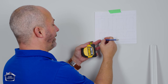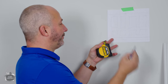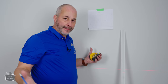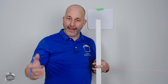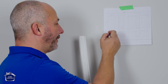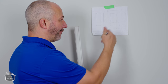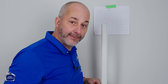Same with the height — take your ceiling height from the baseboard: three gaps minus 18 inches. Draw a line with a laser level, and that line is what you work with. Measure from there to the ceiling minus six, and from there to the floor minus 12. That gives you the bracket dimensions. Trims often come in 14-foot lengths, not 16, so cut in half for a seven-foot piece. At an eight-foot ceiling with three six-inch gaps, every seven-foot piece does a whole side. If your math isn't working out, just make your boxes a little bigger — maybe go to a seven-inch gap.